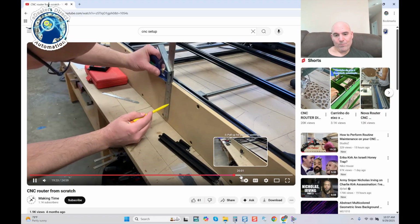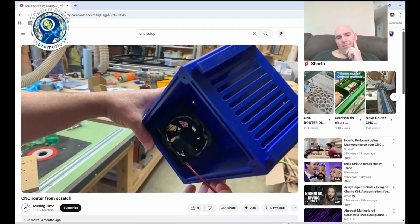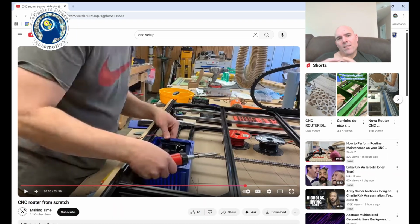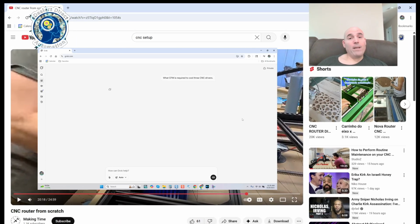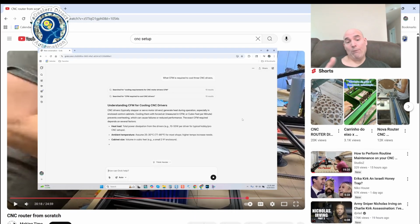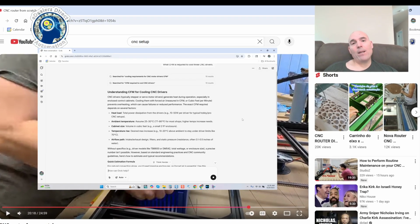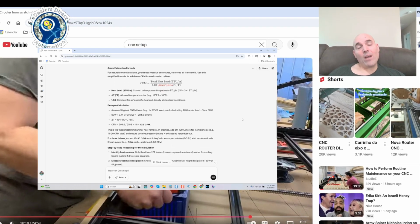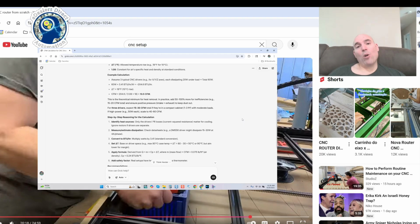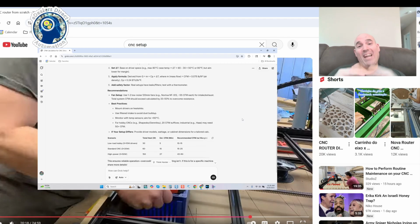I had to cut a hole to make room for it. I 3D printed this box and installed a computer fan to keep the components cool. What size computer fan? How much CFM is the fan blowing? We need to know because we have multiple drives in that little tiny enclosure. So in order to keep them drives cool, inside the operating manual of each drive should tell you what operating temperature is safe. You might even find information regarding the size cooling fan and the amount of CFM required, meaning airflow required to be blown over them to keep them cool.